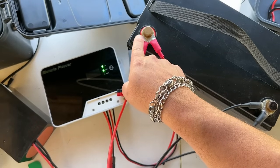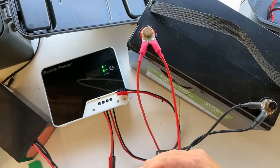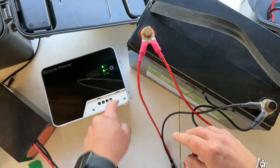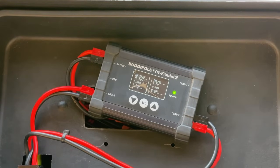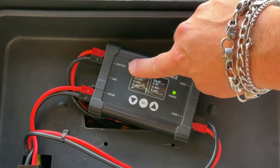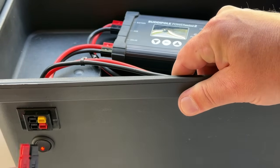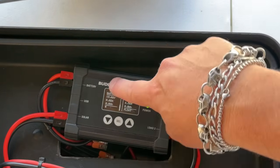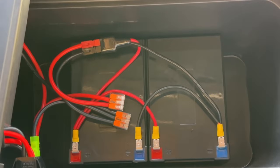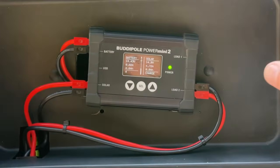From the battery side, we're going to plug that into our battery. I have an Anderson hooked up to this, so we're just going to use this barrel connector to go into my BioEnno battery. Now we're charging this BioEnno battery and I can take my load off of this PowerPole. Battery's at 13.3 volts right now. Conversely, if we use the style battery with the two prongs and two wires, I would plug the charge controller into that and now we're charging this battery and take our load off the second PowerPole. For a bigger battery with screw lugs, I have two separate PowerPole wires going into it. If you're using something like the BuddyPole Power Mini 2, you've got inputs labeled battery, solar, and two loads. I just have a PowerPole going out to a yellow PowerPole for my solar in. So when I plug in the solar panel, it already knows it's got solar in, and that's automatically feeding to the battery.